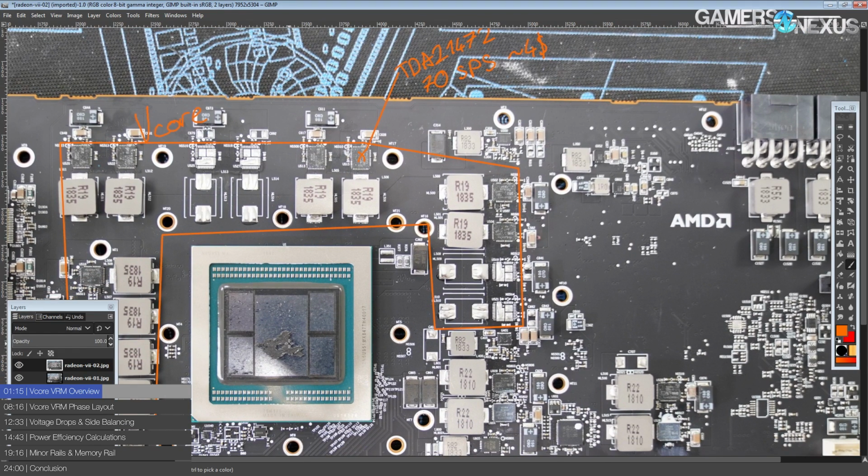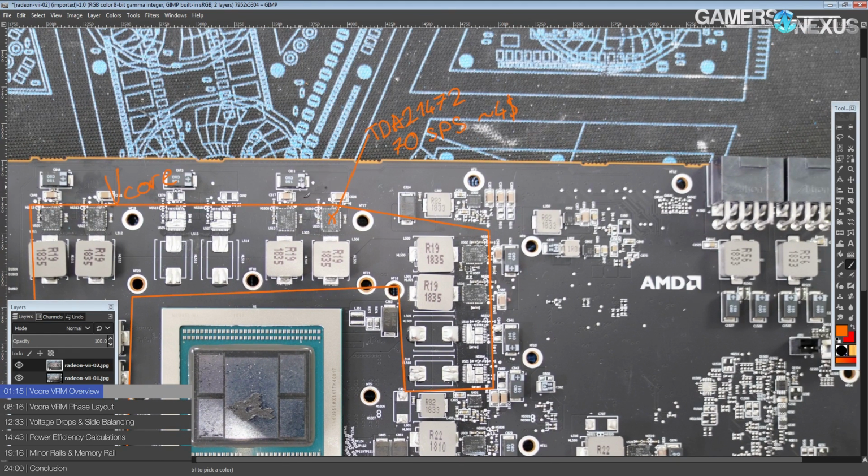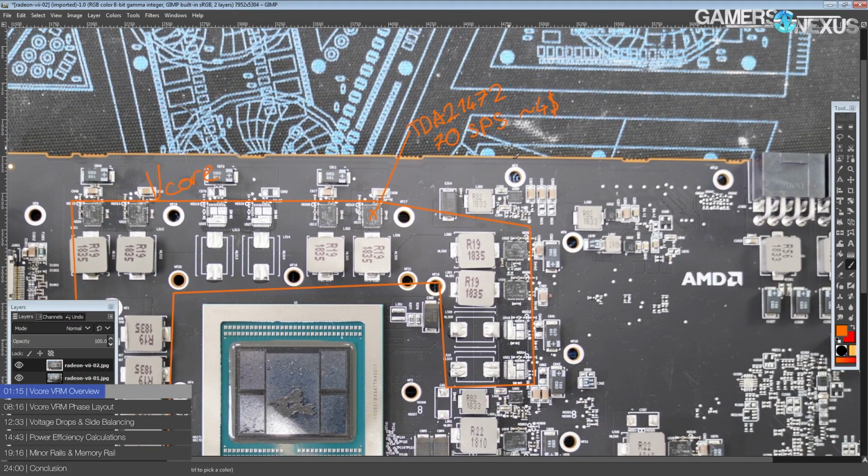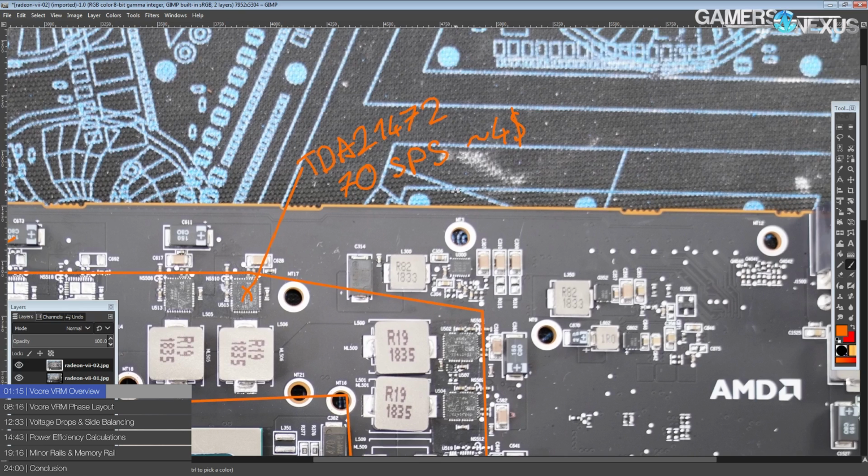Anyway, and a 2 would probably have bandwidth issues, but anyway. So, trying to save some money on the VRM, and then getting the really, really high-end power stages. Now, what makes these special compared to, say, the FDMF 3170 is that these are 70 amp smart power stages, so they have all of the usual features like over current protection, over temperature protection, built-in current monitoring, built-in temperature monitoring, all kinds of cool features like that.